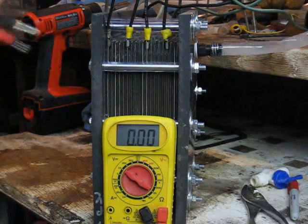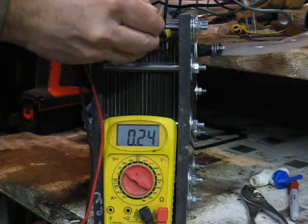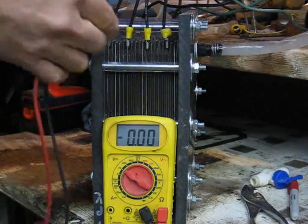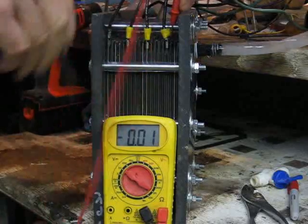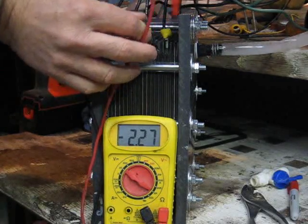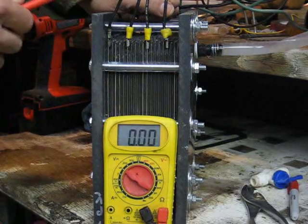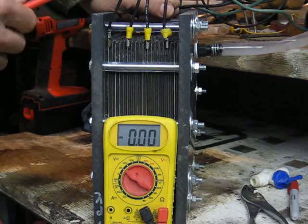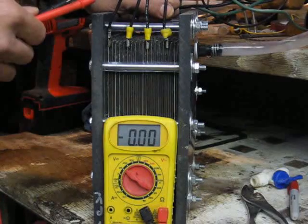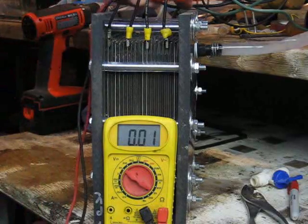I found one problem. The voltage across these two plates I showed you before was just 0.2 volts. The reason is because the connector was shorting out between them — you may have seen the spark there when I pulled it up slightly. Take a look now between the same two plates and there you'll see 2.2 volts, which is about right. So that was causing me trouble. If that had something to do with the big explosion I had the other night I'm not sure, because any arcing was on the outside of the cell rather than the inside. But at least I figured out why my wire was heating up.